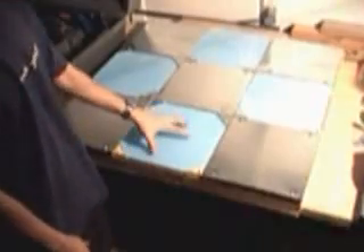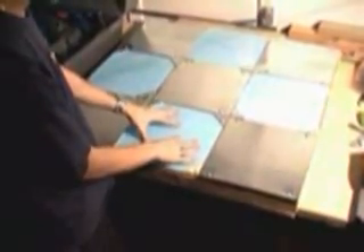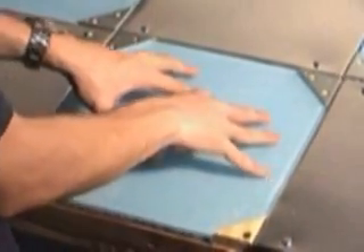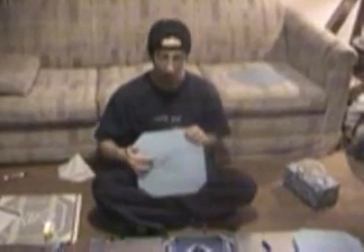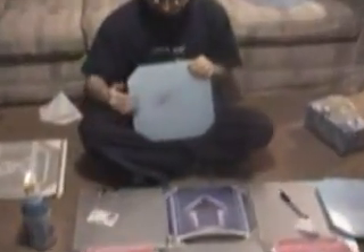Go ahead and trim the rest of the arrows. I finished trimming the acrylic panels — they are all semi-loose, just a little loose but not too loose. They move very well loosely and vertically. After you have your panels fitted and working really well in your arrow wells, you don't want to get the orientation of them mixed up. So what I do is label them as if you're standing from the back of the pad looking towards the top, and label them depending on which arrow — up, down, left, right. This way you won't get them flipped or oriented in different ways.